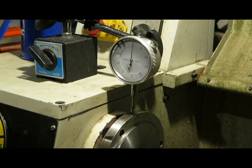And so I've had a quick look at that now, and you'll see the setup I've got. I've just got a hundredths of a millimeter test gauge straight onto the spindle, onto the back plate of the spindle. For my lathe, that spindle plate directly attaches to the shaft, and so it's as close to the base setup as I can possibly get.